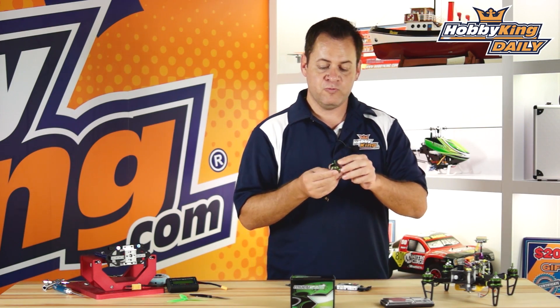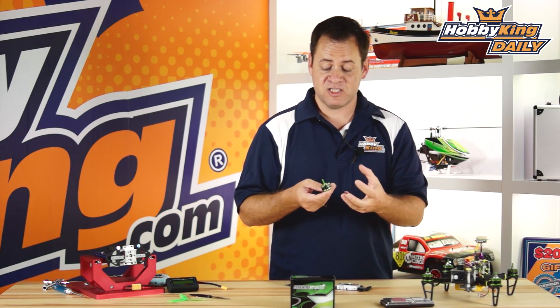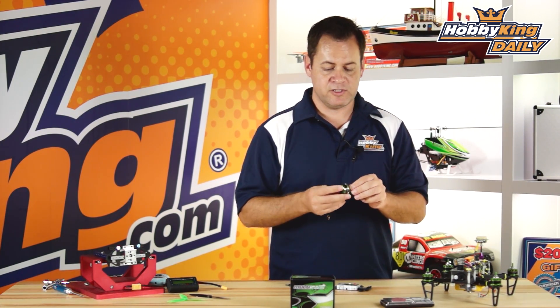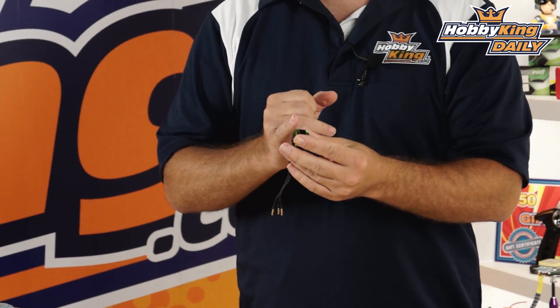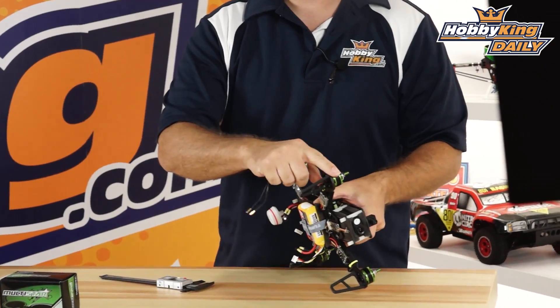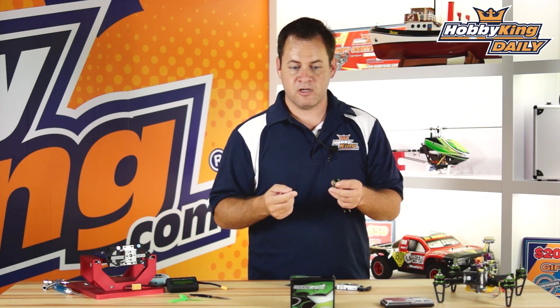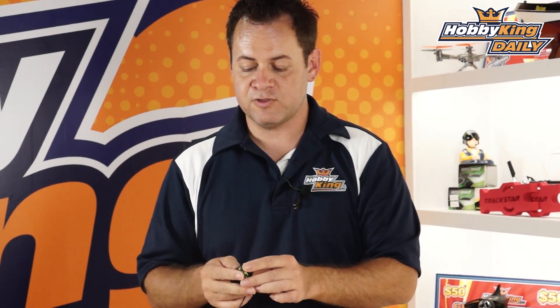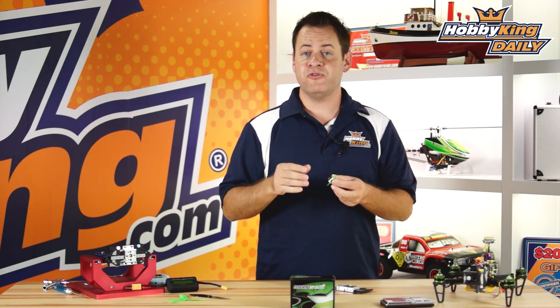This is absolutely critical on this motor when we talk about mounting. When we designed it, we wanted it to be as small and light as possible. The other 2206 and 2204 motors out there are just beasts, so we reduced the housing size on both the top and bottom. But that does leave the windings fairly close to the bottom threads, so you need to make sure the bolts going up into the motor do not contact the windings and damage your motor. Just be aware of the overall length of those screws when assembling.